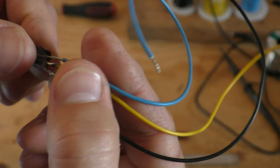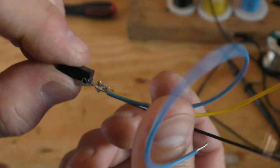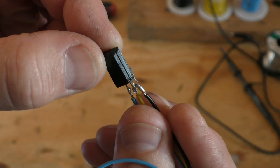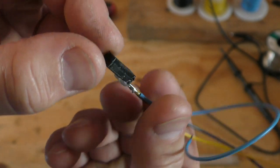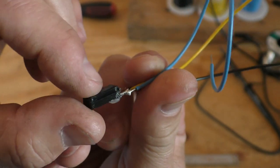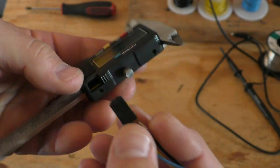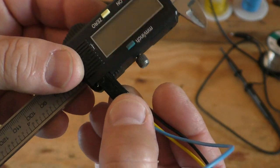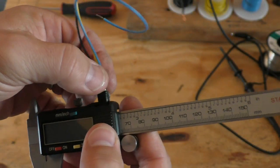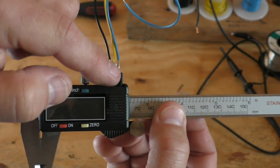There's a small groove on the sides — just looks like a little line but that's a half millimeter groove, and that is necessary. What you do is you just slide that sucker in there, and now I can get the data off of these calipers through this little port.